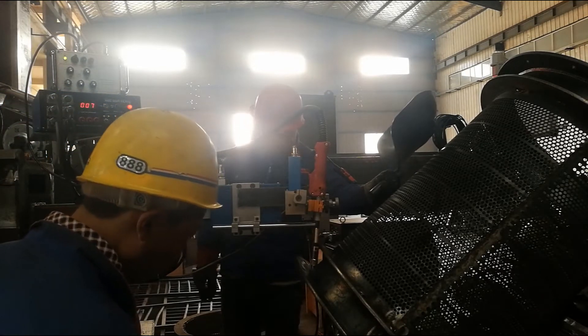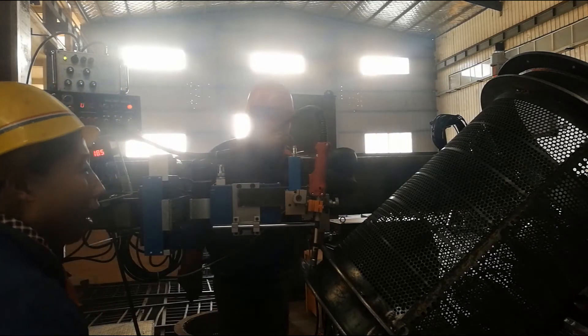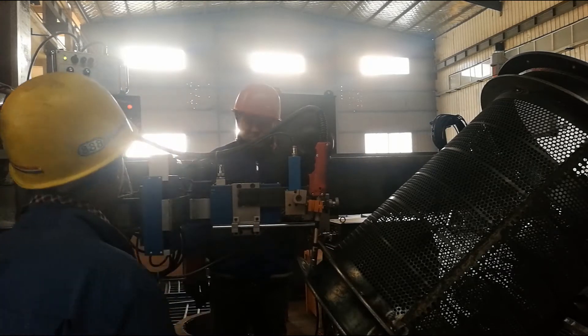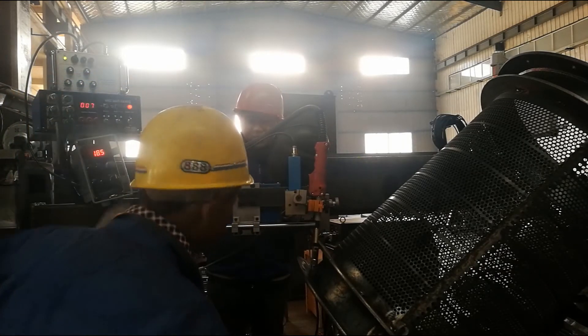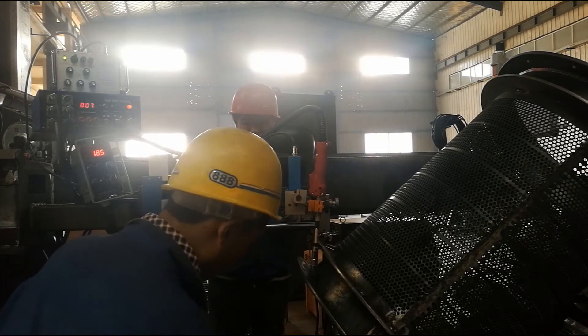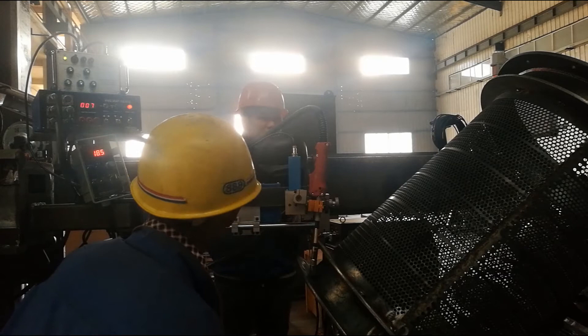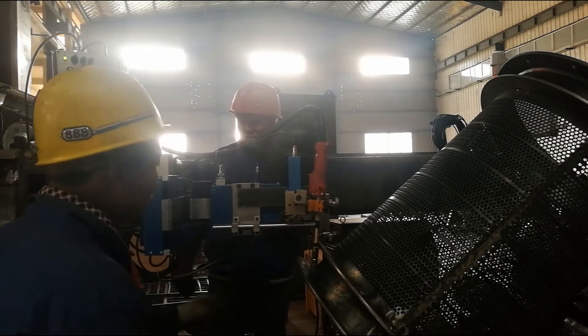The welding torch is guided rapidly and exactly by moving the slides up, down, right and left. The seam tracker has a function to protect a deviation which happens when thin butt welding; the emergency stop function does work when the deviation is occurred, if any. Our seam tracker can be applied to a welding system for automation and unmanned system.